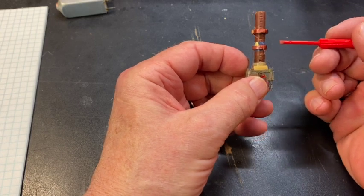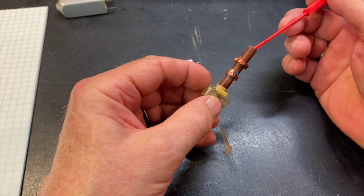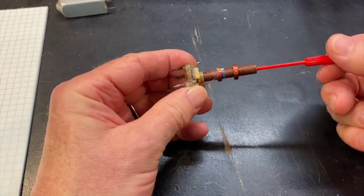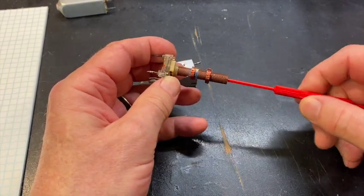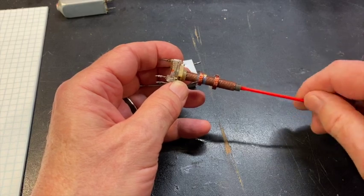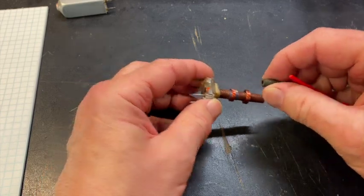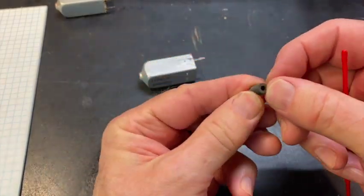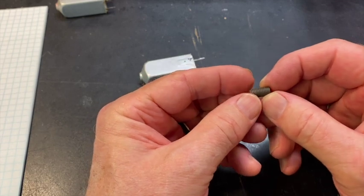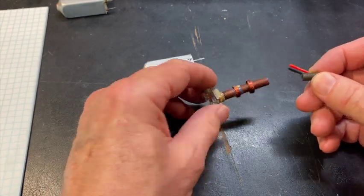of the coil itself. And the way we're changing it, when we adjust a radio with a tool like this, is we're reaching down in here and turning a thing. So let me turn that thing all the way out so you can see what it really is. And here it is. It's a powdered metal, powdered iron slug, they're called. It's powder and epoxy, or powder and some other binding agent like that, iron. And it goes right down inside.